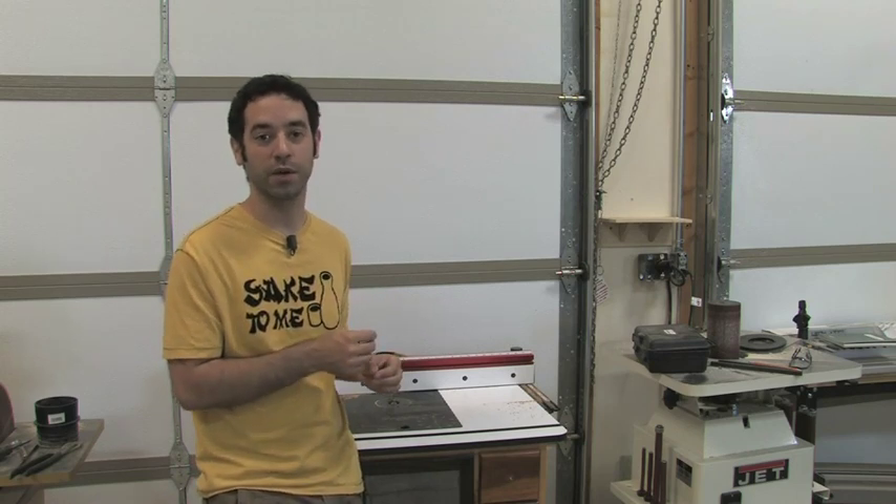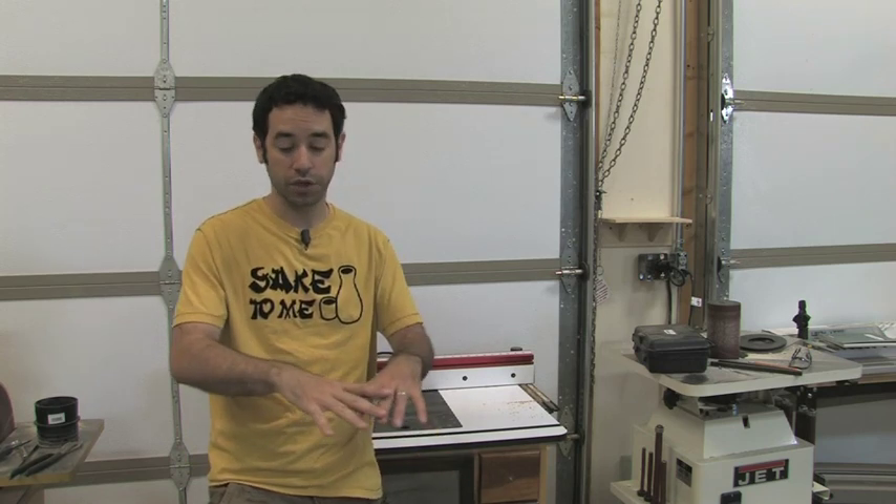To be completely honest, I absolutely avoid at all costs doing small parts at the router table. If the piece is big enough that I just need to round over some edges — someone asked about routing the outer perimeter of yo-yo blanks — my suggestion was to get a piece of plywood, double-stick tape all the blanks to the plywood surface, and then use a laminate trimmer around the outside. I feel much more comfortable using a small router and taking it to the workpiece, instead of taking the workpiece to a router table.